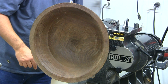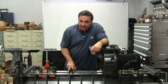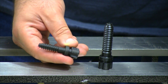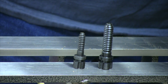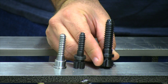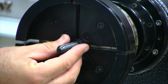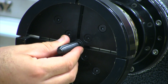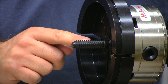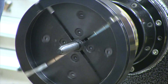Also, one more thing I'd like to show you. To go along with the need to handle larger blanks on a screw chuck, we've developed a new woodworm-type screw. Here is the original one for the Hurricane Chucks, and this one is a Vicmark. We have a new one here for large bowls, perfectly suited for these large jaws. This wood screw is almost a full half-inch in diameter, with extra coarse screw threads to handle large bowls — big enough for the capacity of this lathe.